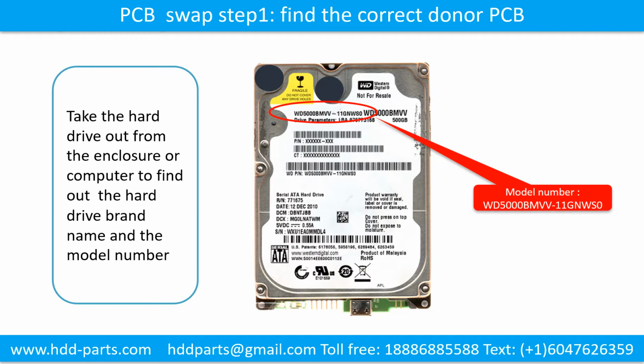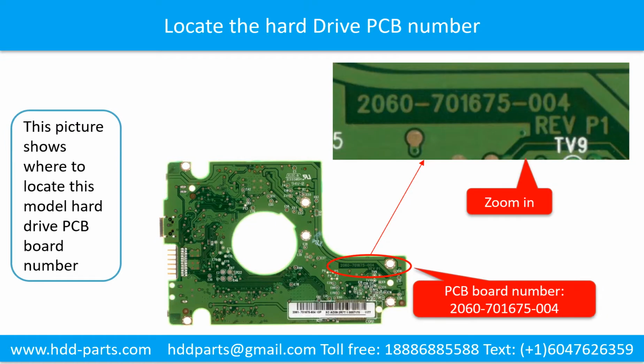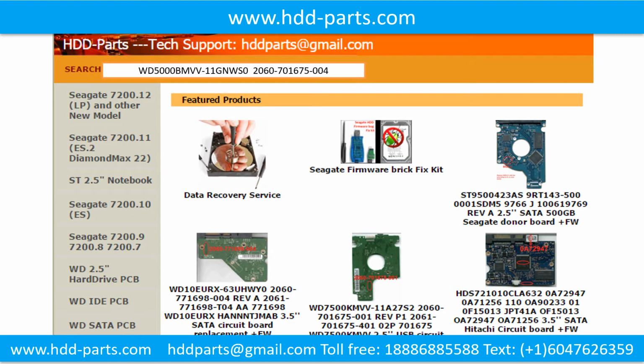Locate the hard drive model number on the front of the hard drive label. Locate the hard drive PCB board number. Different brand names have different PCB boards, and the PCB board numbers are different. You may go to hddparts.com to check other brand name PCB board numbers. After finding the hard drive model number and the PCB board number, we use them as a reference to search for the correct donor board.